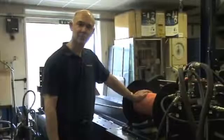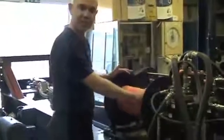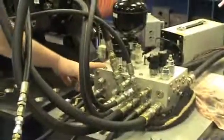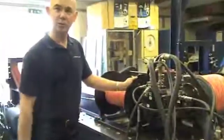Kevin's going to explain what we're doing with this captive winch today. First, we're going to check that the stowage drum rope lays correctly on it. Then we're going to check the manifold and make sure that all the pressures and flows are correct. Then we'll do a functional test of the unit to make sure that it functions correctly and pulls the full load.